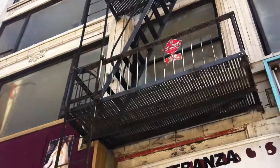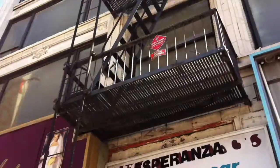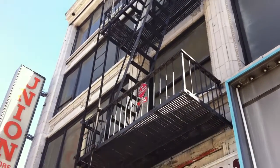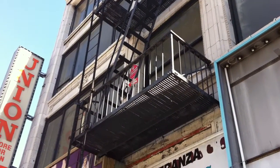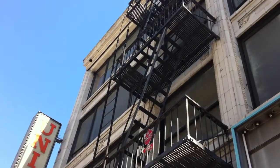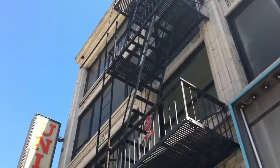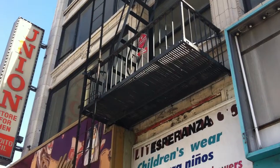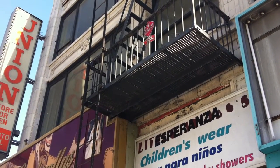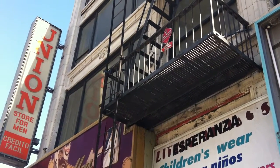Fire escapes. If I was a structural engineer inspecting a fire escape, there are two requirements: it must be structurally sound and must be kept painted in preparation for a load test. In lieu of a load test, I can certify the fire escape if I can eliminate some of the unknowns, which would only be verified through a load test. The verification process is to verify a connection, reinforce a connection, duplicate a connection, or nullify a connection in order to forego a load test.